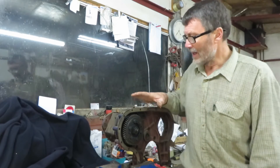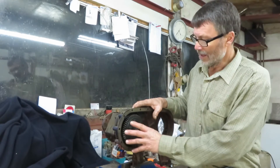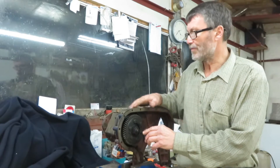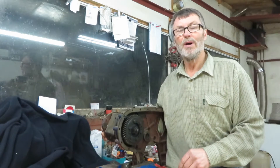Here I have the back half of the timing case of a 3.8 BMC engine. This here is the drive timing gear that meshes with the rest of the gears on the bearings and shaft that drive the injector pump. You can see here it's got the casting on it that takes the Simms mini mech pump on a Nuffield 460 or 1060.